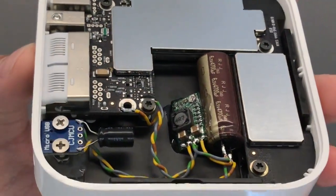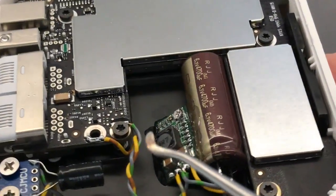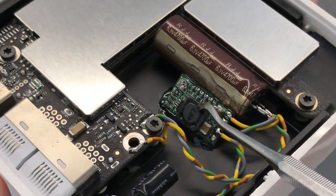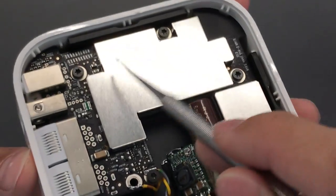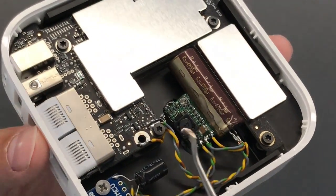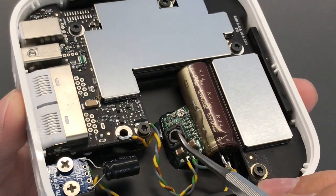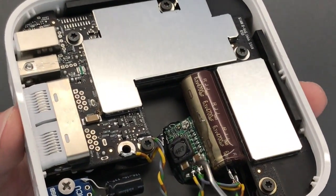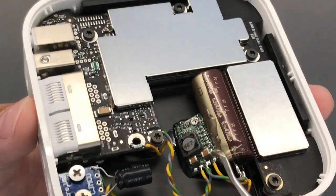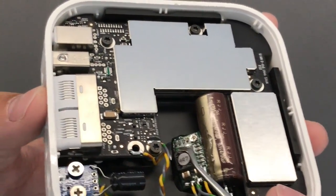This is basically the core of the operation, and mainly the reason I'm making this video, because a lot of people seem to not know about these and they're really great. These are buck converters and they are stupidly efficient. Standby draw is 0.1 milliamps. The efficiency is very good, the power output capabilities are very good, and they do have short circuit protection, which some other small form factor buck converters do not have. They're also very cheap — around a dollar or less.